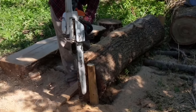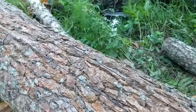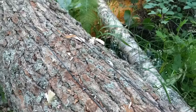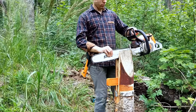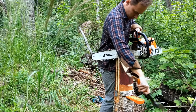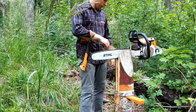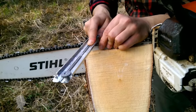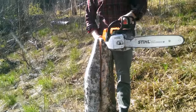Next we need to lay out the cuts. You can use a rope or a bungee cord as a guide — just stretch it between two nails and put a couple of staples or bent nails in between. A brighter bungee cord with stripes is a better choice than a black cord. Be careful not to run into a staple, as a properly sharpened chain is very important for a straight cut. The chain has to have evenly worn sharp teeth on both sides. I usually file my ripping chains to a five to ten degree angle. All of the depth gauges should have the same setting — otherwise the saw won't be able to make a straight cut even if you use a guide or a sawmill attachment.